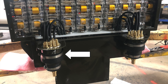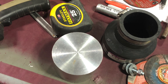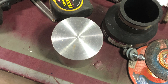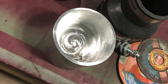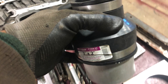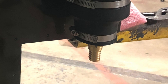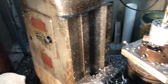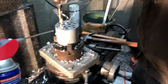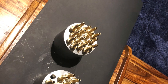Bear in mind that one manifold is an inlet and the other manifold is an outlet. We created these manifolds by machining out a solid cylinder of aluminum until it has about a quarter-inch thick wall. Then we put a rubber reducer on it from three inches to two inches. On the two-inch side, we put another reducer — a large barb that is the receiving end of the glycol from the water pump. Next, we drilled evenly spaced 3/16-inch holes in the top of the cylinders and then tapped threads in so that we could screw our barbs in.